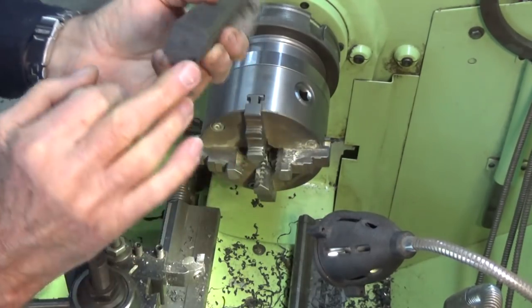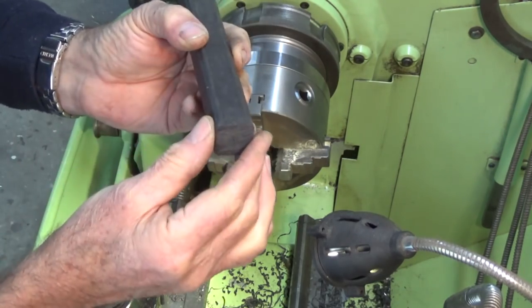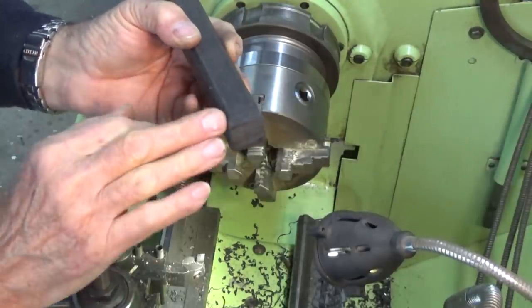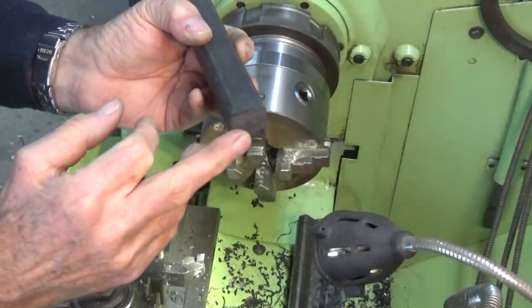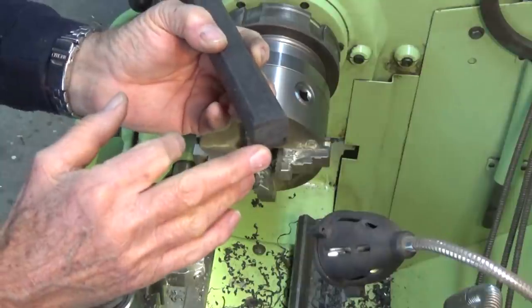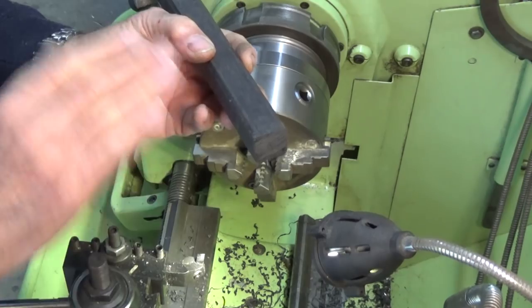And then I realized that this recycled plastic has actually got steel strands in it. And I'm guessing they've used recycled tire cases to do this, and they just haven't bothered taking the steel out. And I thought that might be bad for my tungsten carbide tip circular saw blade, which I keep exclusively for wood where I can. So I think I'm going to have to go back to plan A and do these on the lathe.